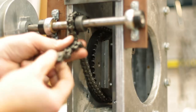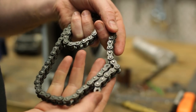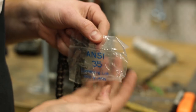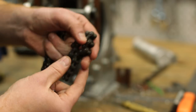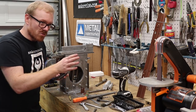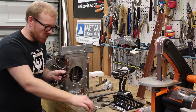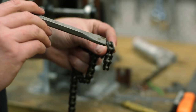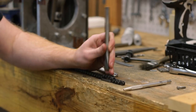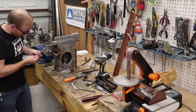I took this chain and wrapped it around, giving myself a little bit of extra slack. I can always take out more links, but I made a little bit of a scribe mark with my diamond scribe on the link that I need to remove. The coupling link has a little groove cut on the ends of the pins that go through the chain, and that way it can clip in there. Pretty much what I'm going to do is use my little belt sander to grind down the ends of the pins that stick through, and that way I can use a cold chisel and knock off one of the sides. If I need to come back and take off more I can, but I can't put it back. I'm installing the connecting link — this is going to join up this chain, hopefully at the right length.